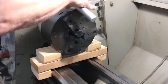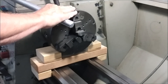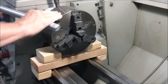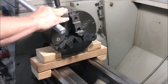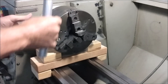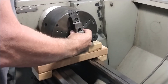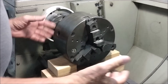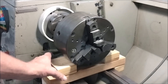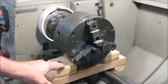Give me 30 seconds to unloosen my cams here. No stress whatsoever — I'm not concerned about this chuck falling off because I know it's trapped right here. I'm going to give it a shock to release it off the taper. Doesn't get a whole lot easier than that, guys — it's safe, it's easy. The board won't go forward or backward on the lathe, and the chuck won't roll because it's chocked.